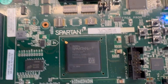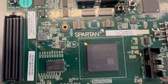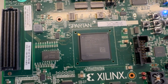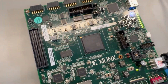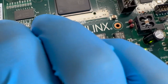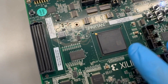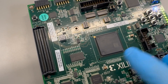So why even bother with the S100? For me, aside from having ideas for the future and using these 400 pins, I would like to attach the entire Minimig on the board itself. There is a high-density connector called FMC LPC that hopefully I'll be able to use. Unfortunately, this chip has 400 pins but it seems like not all of them are attached.